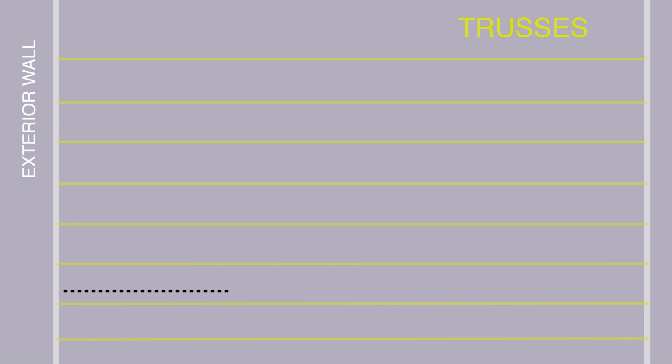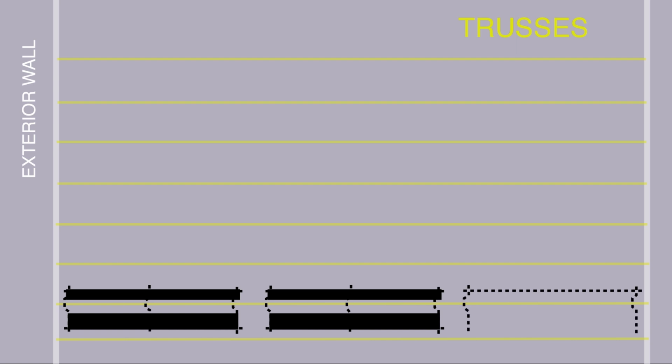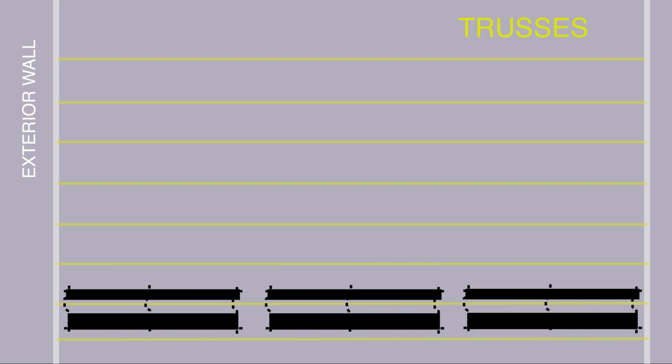The head cut should run approximately 8 feet prior to making the first parallel cut. The second sawyer will start with a parallel cut, followed by a base cut. The second sawyer will input parallel cuts every 4 feet. The second sawyer is going to complete the L with a parallel cut and a base cut every 4 feet.